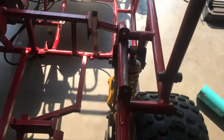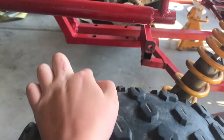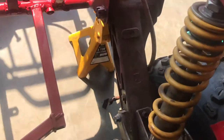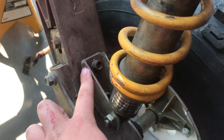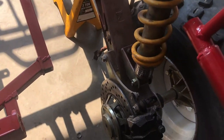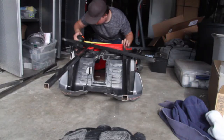The frame hasn't been looking this nice since — probably ever. So now I'm going to have to extend the swing arm backwards so that the CV axles meet up with it, because otherwise the axles would be going at an angle and that's going to cause a lot of wear. These don't need to come back very far — I'm going to make a plate that comes back to here, flip the mount around to right there, and that should be it. After that's done I can mount the engine and get the exhaust done.